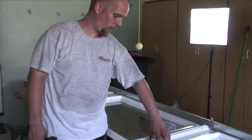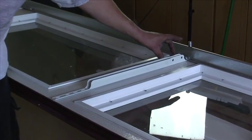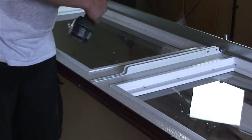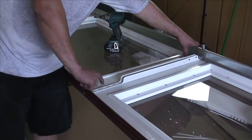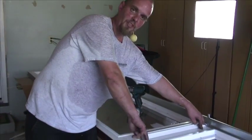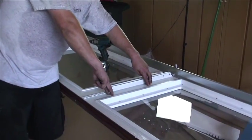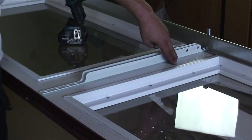You should always use a full operator bracket so it supports off the entire panel, not just one small section. A lot of people forget that there's only a small section inside of this door. There's a secondary lock plate, as they call it, that locks the hardware to the door. If you're up in here, in this midsection, there's nothing in here short of this back steel. So if the door freezes, the ground door's heavy, something goes into distress, that operator bracket's going to rip right off the back of the door.